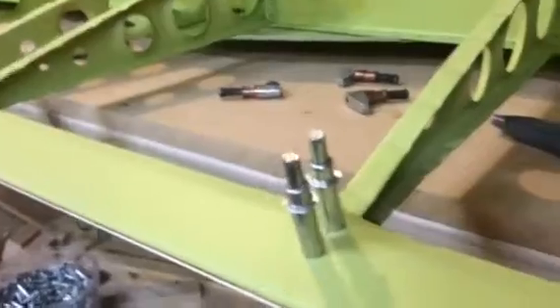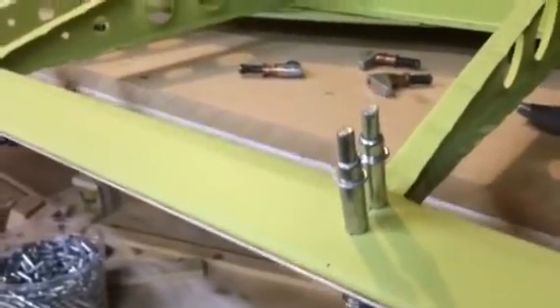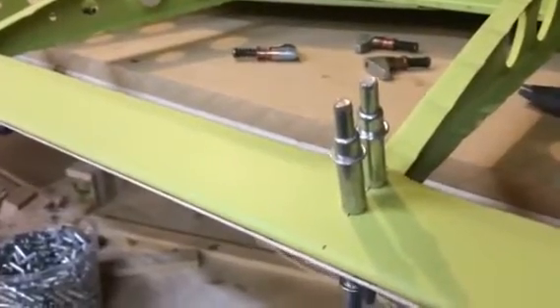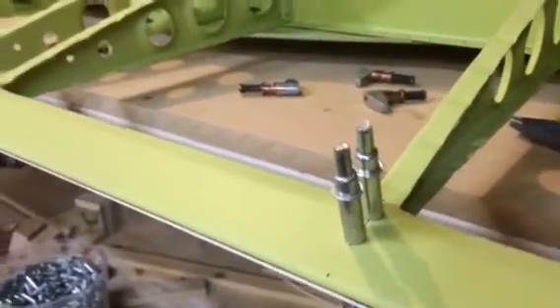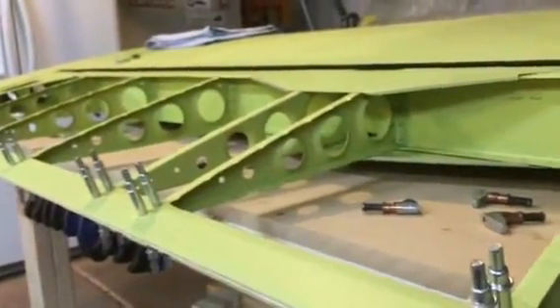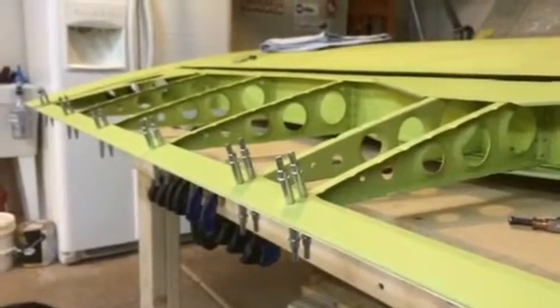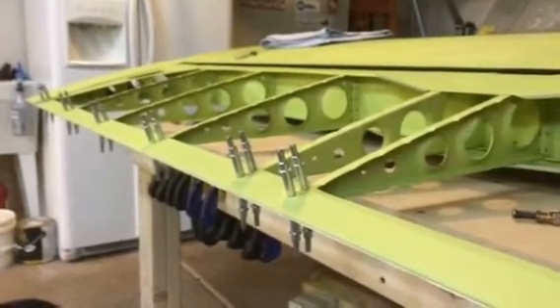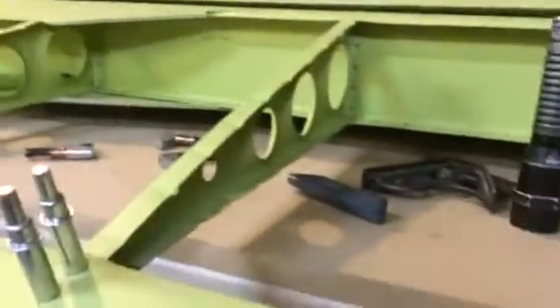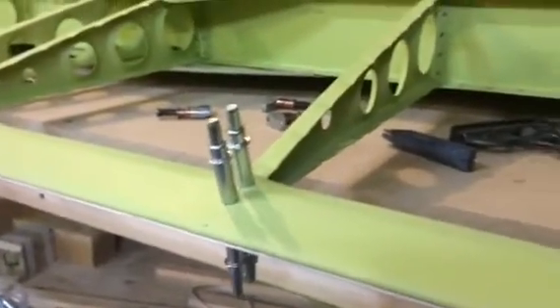I think trying to bend in the bends on your trailing edge and then mash them out when you put your rivets in — that's a lot of work and effort that I wouldn't recommend. If you're building this wing, don't take my word for it — certainly talk to Mr. Barrows, make your own decision. Don't let me talk you into a wing failure. But I'm very confident that once this is completed and I bob stick this flange in here, it will be exactly what the designer intended.